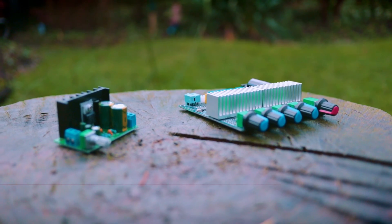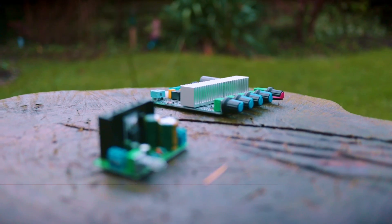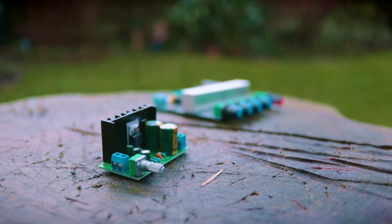There are also stories of people who claim they can tell the difference between a Class D amplifier and, say, a Class A amplifier. But that's tricky, because when you compare them you're not only comparing different amplifier classes — you're also comparing different products, which will always sound different anyway. So it's very difficult to get an apples-to-apples comparison. Generally speaking, Class D amplifiers sound absolutely fine — there is no noticeable difference whatsoever, but they are way more efficient, which means you can have crazy powerful amplifiers in a super small form factor, exactly what you need for the loudest Bluetooth speaker.